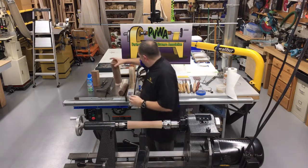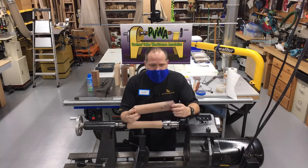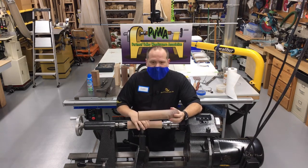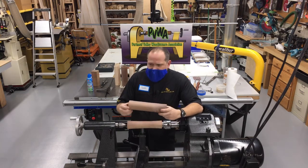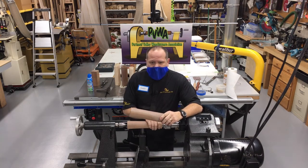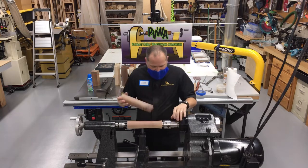And then in this case, I like about 2.5 inches in diameter on the ends, and so I usually turn them down to about 2.5 inches, and then about 2 inches or so in the middle, but those are just rough. I usually start at 2.5 on the two ends, and then from there, just turn down the middle to kind of what looks good and go from there. So I turn it down, put a tenon on it.